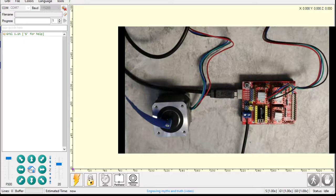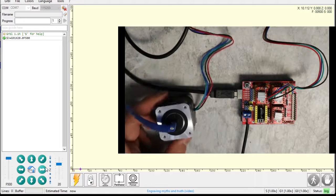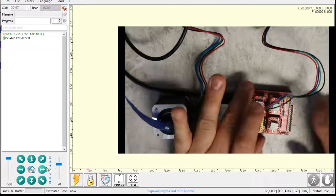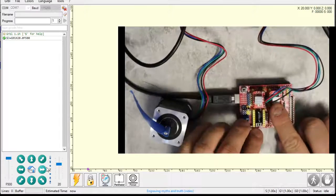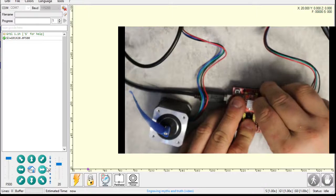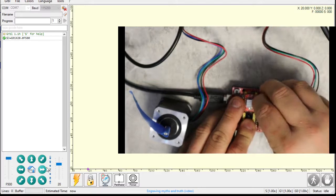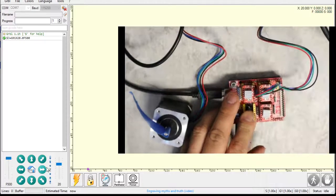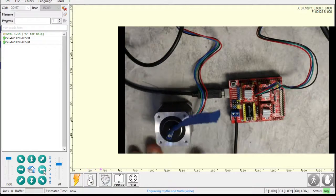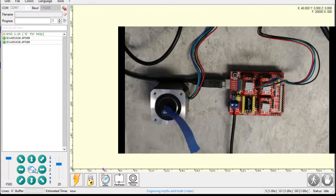Let's give this a try. I'm going to go to my program — I'm connected — and just tell it to move to the right. Not moving quite right, let's see why. I didn't put my stepper connector on correctly; it's actually missing a pin. Let's try that. Look at that — that sounds beautiful.